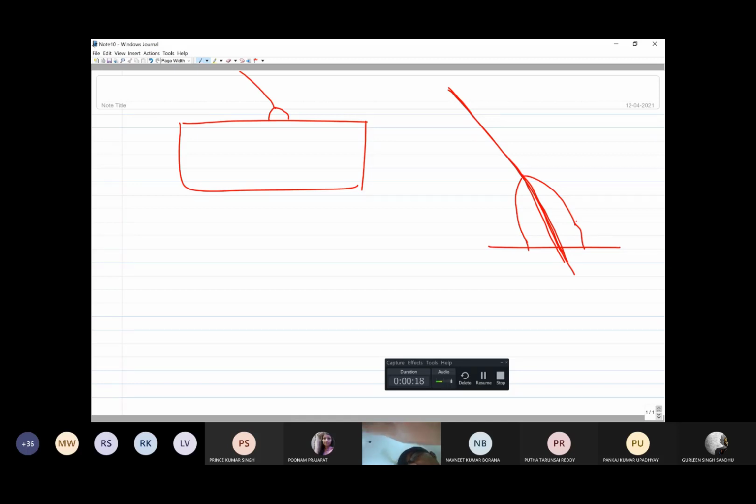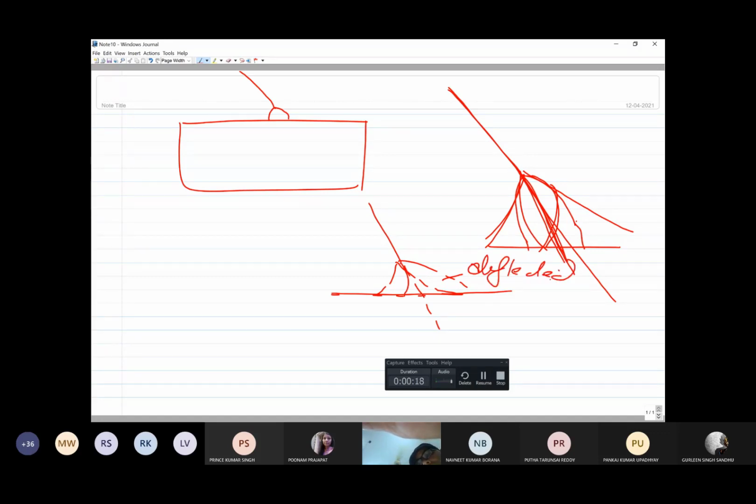Okay, so if this is happening, there is no problem, but sometimes the arc tends to move ahead of the axis, or the arc tends to move backward like this. So the arc should go straight, but instead it can move this way, or it can move backward. So instead of following the axis of the electrode, the arc is getting deflected in the direction of the welding. Say this is the direction of welding, so the arc is deflected in the direction of welding, or the arc is deflected backward of the direction of welding.